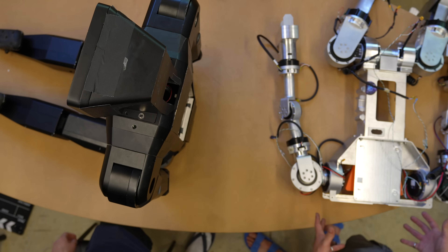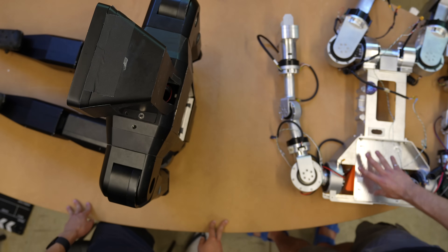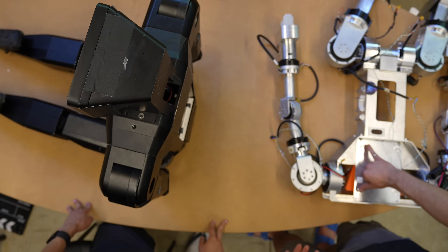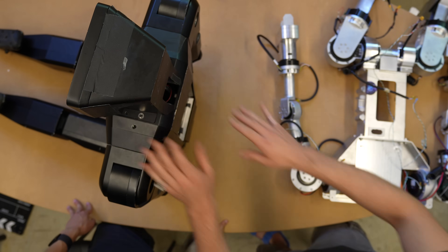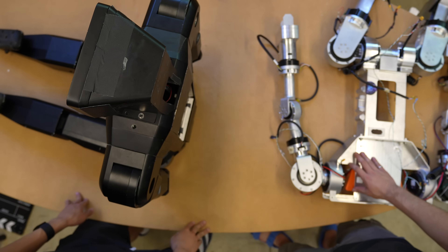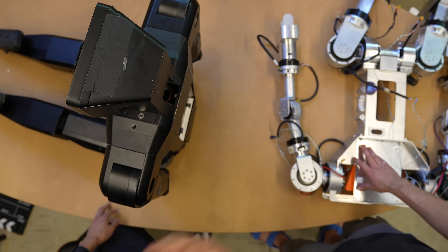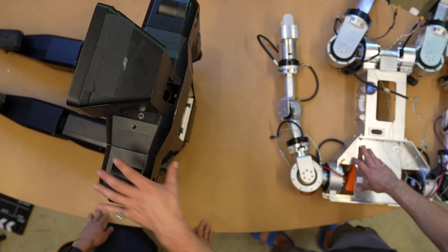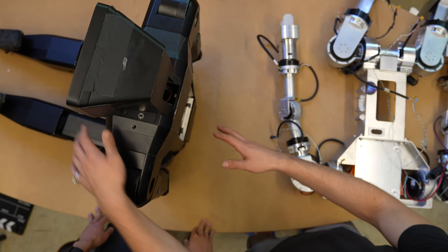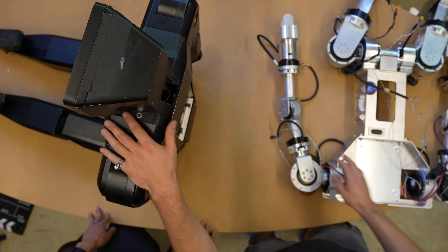On our V0.1, there's a distinct lack of head — we were packaging the control board in the center of the torso along with the rest of the electronics. What we realized is this isn't a great user experience in terms of serviceability and future upgrades. So on the new robot, we have it up on top of the torso. This is really important because we wanted users to be able to easily swap out their heads to upgrade or customize for a different application — for example, adding a depth sensor with a 3D printed head on a standard interface. We're also looking at upgrading the CAN control board and improving the interface out the back of the neck.